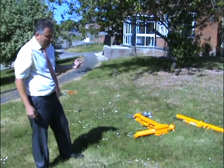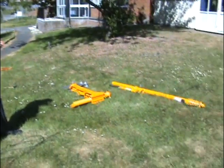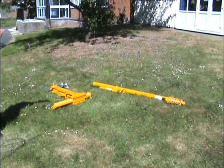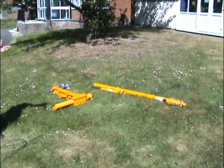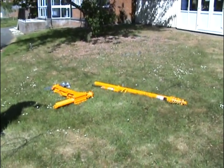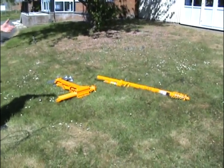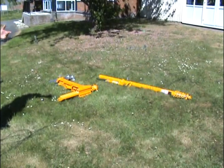This is a cutie mast with a tripod. This is a six-section mast. What we're going to do is assemble the six-metre mast, which has four sections. We're going to leave two of the sections locked in. We're going to put the tripod up, erect the mast, and attach the guy ropes.